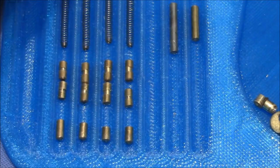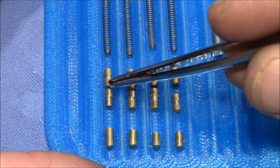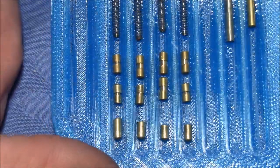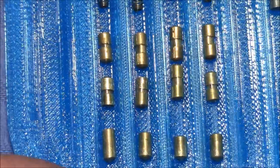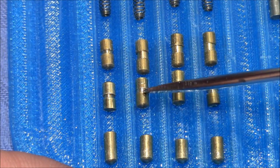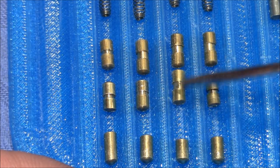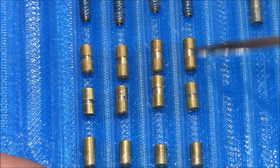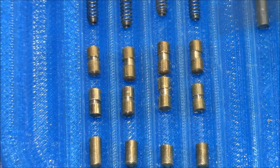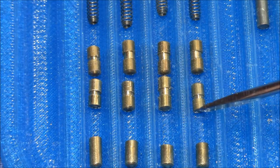And when we move on to the pins, it's really funny that they have put in some kind of security pins, and two of them for every pin stack. These are kind of spools, as it looks like. But they have different dimensions or different properties. Here we have spools with a very thin middle part, and here it's a little bit bigger. Then we have thin again. I think these are just arbitrary pins. So what the machine spit out, I don't know.